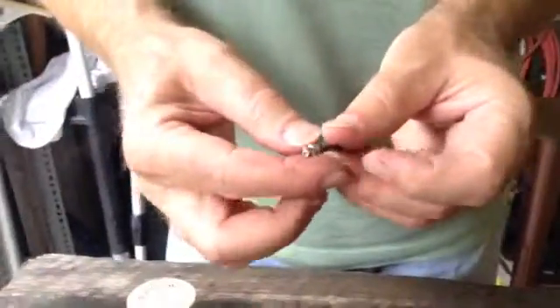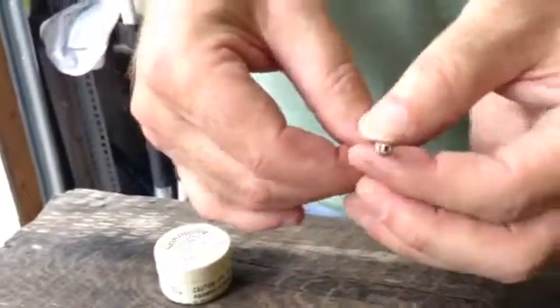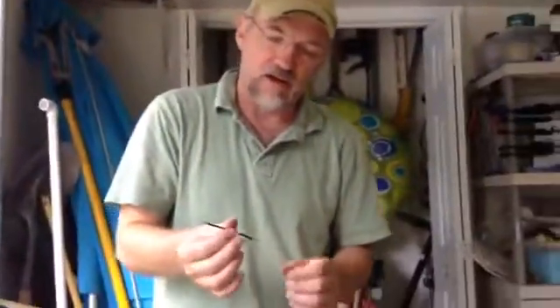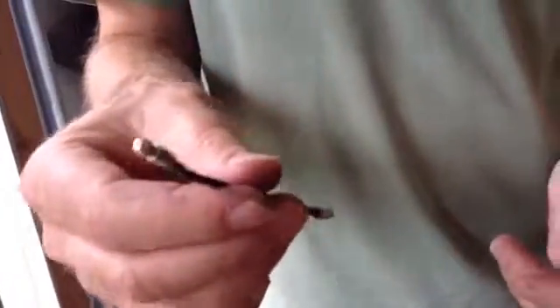I got a little bit burned on the end there. I could clean that up some, but it's the ground wire I'm going after here because I'm trying to connect another ground with a four-way connector. But that should do it. What I will do when it cools off more is pull on the ends to make sure I've got a good solid connection with the solder on the inside. And if it stays in there, it means it's connected well and I don't have a dry socket. Anyway, there's how I do it. I'm sure there's other people who've got other methods, but it works good for me. See you later. Bye.